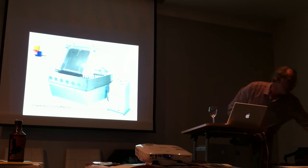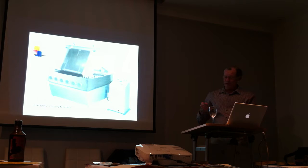On some of these you see here, we paint shellac on that, because the more areas that there are etching away, you weaken the acid solution so it doesn't go as long, so you've got to make up in here, so you just sort of keep up the image. And you cut that out later and mount it up on a plate.